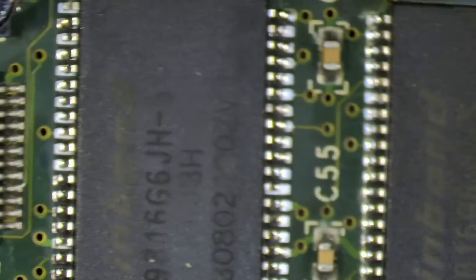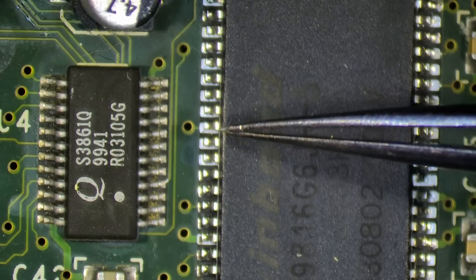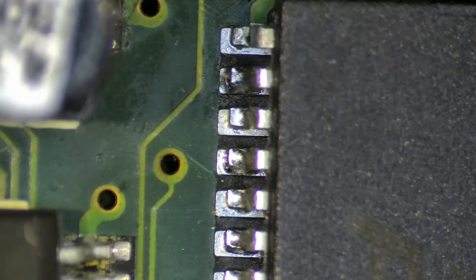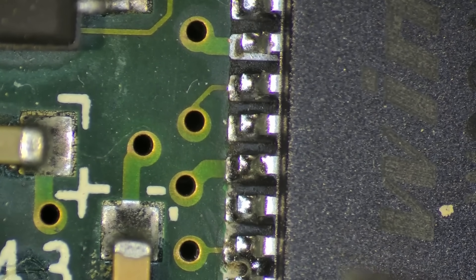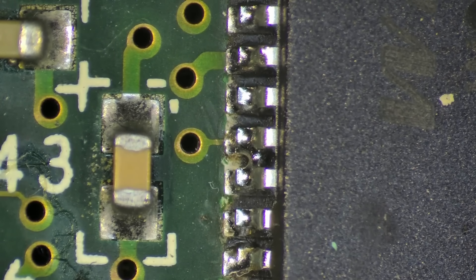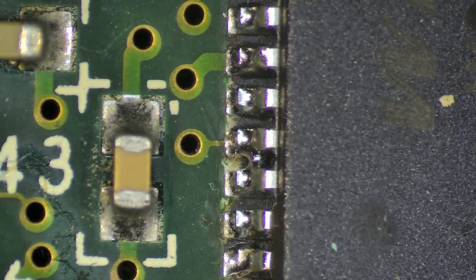Let's have a look at the memory chips. Here I can see some of the legs don't have any solder — that's concerning. They do look like they have some solder, but just very minimal. And here's a solder bridge. Here's the first one. The owner told me they checked for solder bridges and couldn't see any. This is so tiny — you need some magnification to find this stuff.